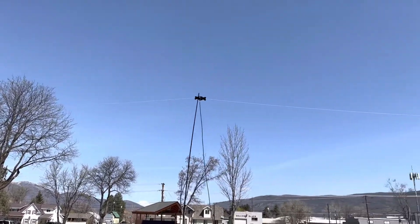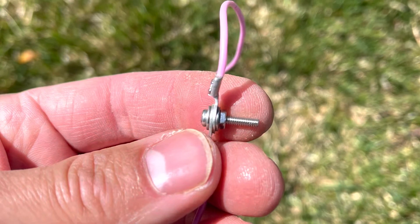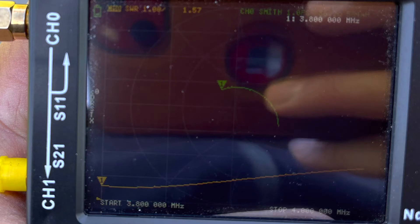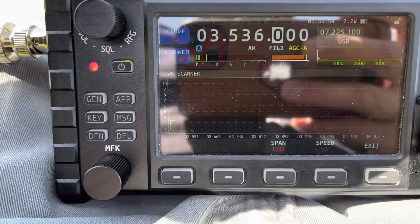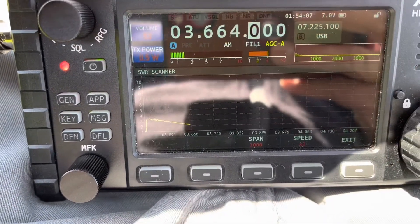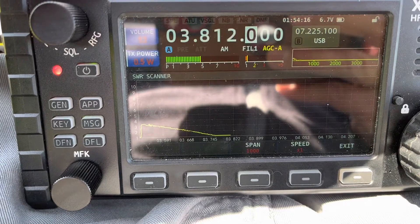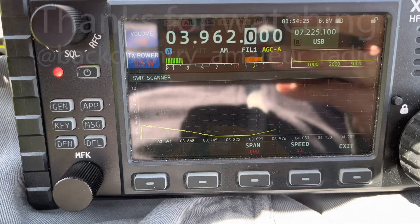So I went to a city park and found two trees that are far enough apart — just about the right distance — joined the wires and put it up. It takes a little while when you've got so much wire; there's a lot of walking between trees to get things up properly, and then I put the mast up in the middle. My initial read on the SWR wasn't too far off — it was 3.75 MHz initially — so I cut off about 11.5 inches off of each end and was able to bring it into 3.8 to 3.9 MHz with an SWR of about 1.5:1, which is fantastic. The frequency is so low and the wavelengths are so large that adjustments to the antenna have to be pretty dramatic. To do digital, I'm going to have to add 3 feet on the end of each leg, but for now this thing's ready to test, and I'll be sharing that in the next video.